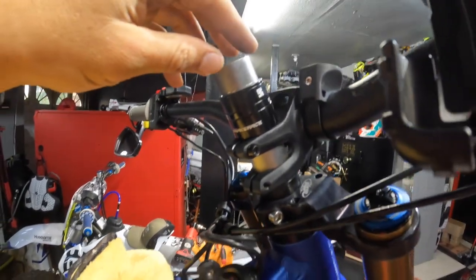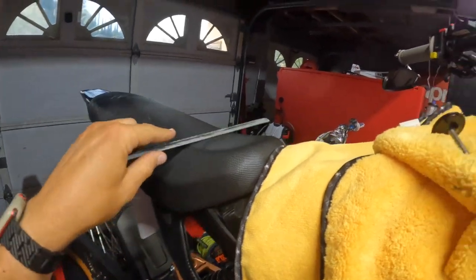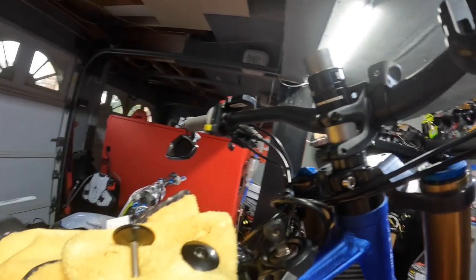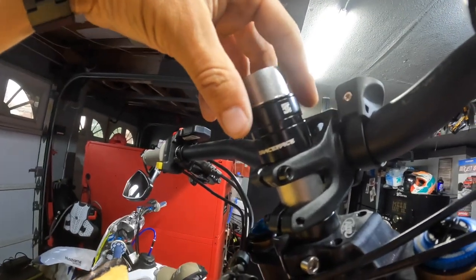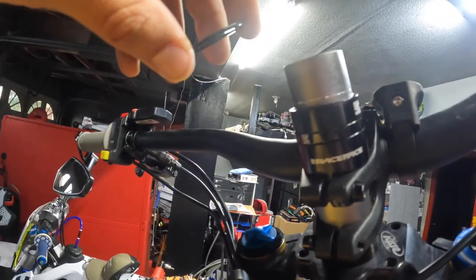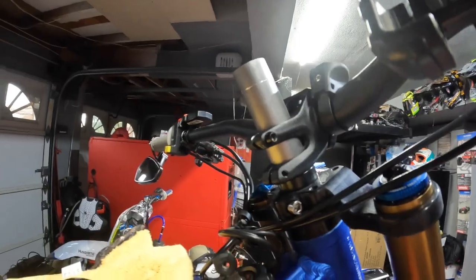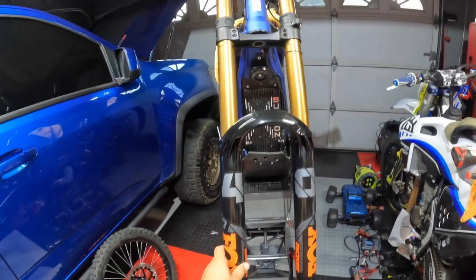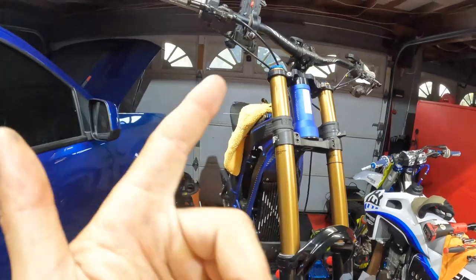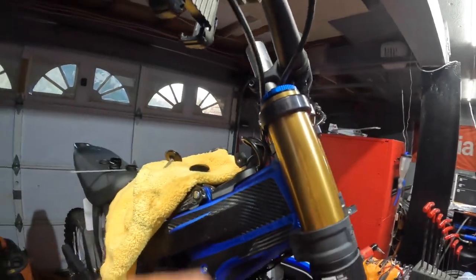Alright boys, here's what I did. To get my line, I grabbed one of these little blades and just went all the way around, doing this rather than taking it off and marking it. Now I know the very bottom of this line — I've still got to go at least a mil or two past that — and you can see that nice shiny line that came out. Now I can just take this off, pull this down, make my cut, and we should be pretty close. I figured I'd share that technique rather than leave you guys in the dark — a simple solution to marking it so you hopefully don't have to recut.